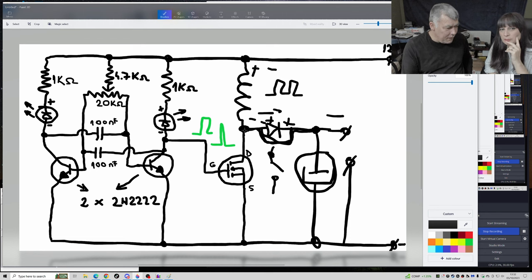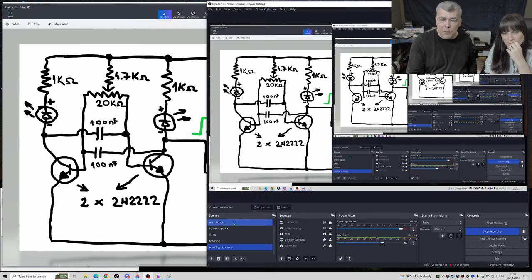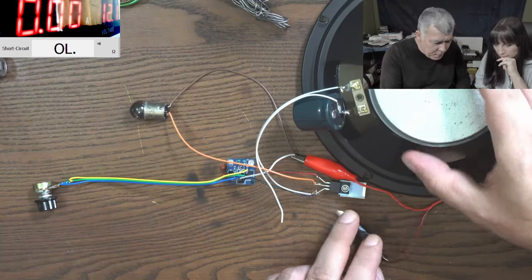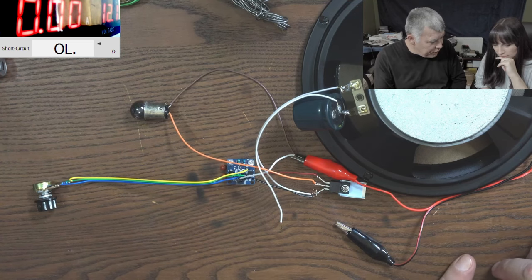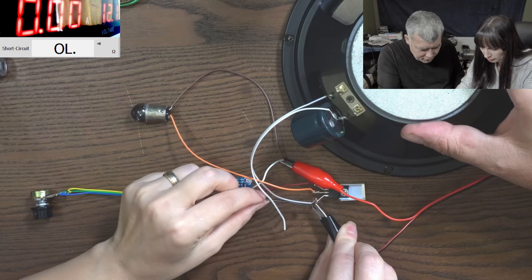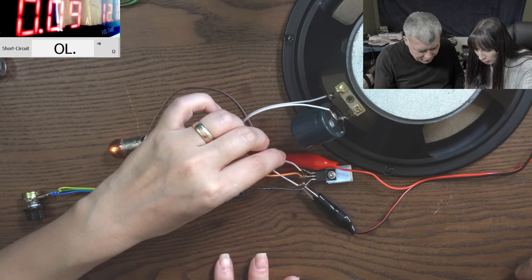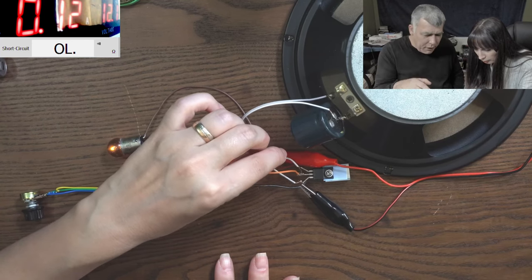Before building this circuit, I want to raise the frequency on the PWM generator. We increase frequency by lowering the capacitor — I want to change the capacitors to about 10 times smaller, maybe a few nanofarad capacitors. While we still have the speaker connected, let's change the capacitor and hear the new frequency. Touch the speaker on the drain of the MOSFET to test it.